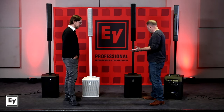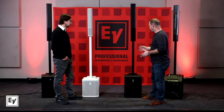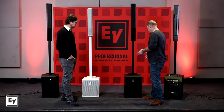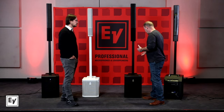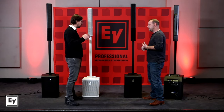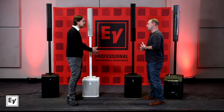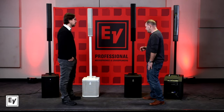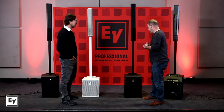It's really easy to do — in the DSP you just dial it in by distance in feet or meters. You say it's 50 feet away, dial in 50 feet, and everything's time-aligned and you're set. It's incredible what's in here. On the back you've got a couple of combo jacks — quarter-inch and XLR — plus mic/line inputs, a stereo RCA input, and of course stereo Bluetooth so you can pair your mobile device and stream directly without any cables whatsoever.